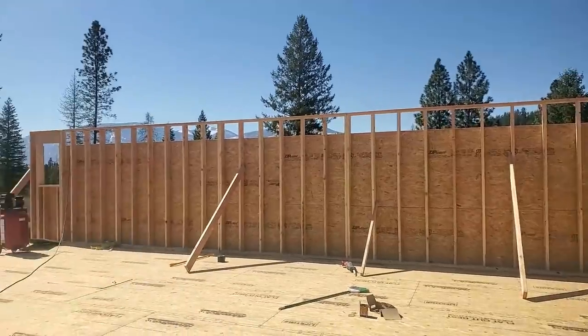Okay, very busy morning, but this back wall, this super long wall that's very boring on the back side of our house, is up. It is sheathed. At least the majority of it is. We still have a couple sections right back here that we need to do. The middle will not have anything again because that's a gable end that we are framing out after the fact. And then once that is done, we need to tape all of our seams. But we're hitting pause for the day.